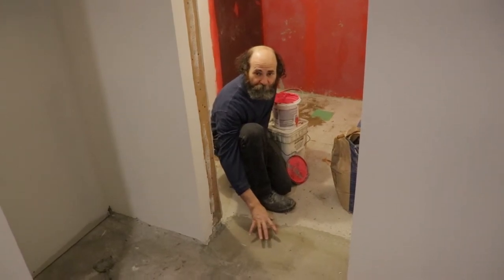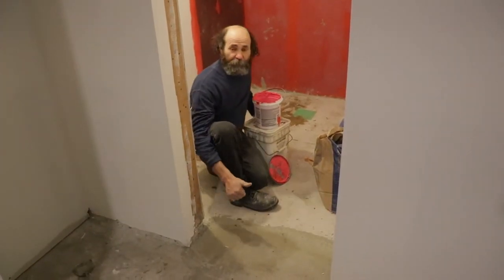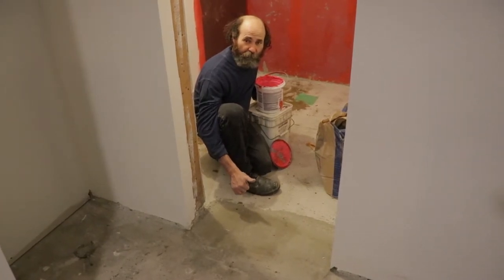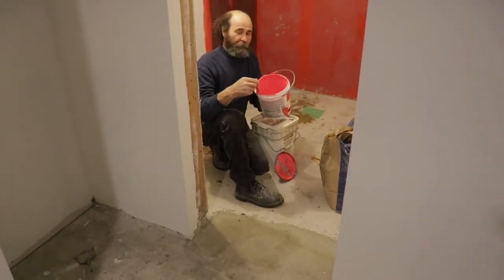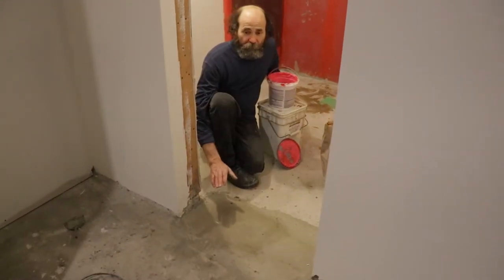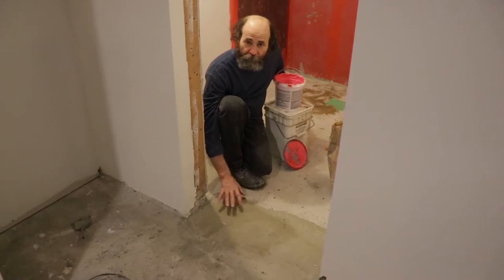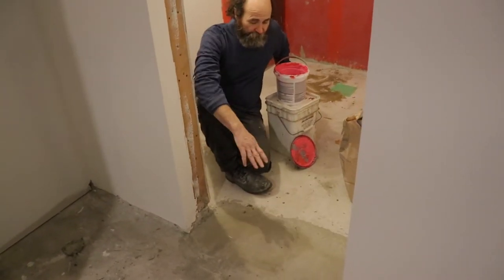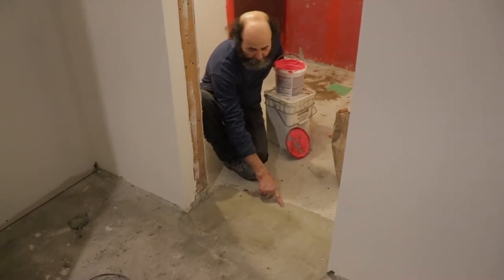Hello my friend - we already finished the patch. We didn't get to show you the whole process, but I will explain where we left off on the video. We left off on the part where we put the first layer of cement to seal it. After that we waited a couple days to dry very good and put some heat on. Once it was very dry, we used the red guard to seal it - the red guard waterproof compound. After the red guard was dry - takes about one day to dry very good - after that we just put the top layer of cement. Now like you guys can see, it's drying up - this was done a day ago. And you can see the moisture is just gone - no moisture anymore. The cement is still fresh, but like you can see the parts that are dry are brown - no moisture.